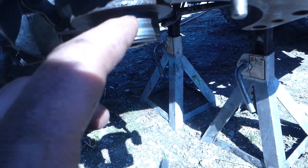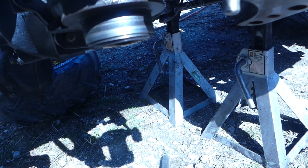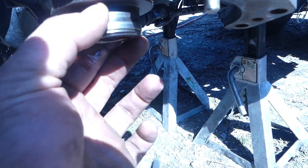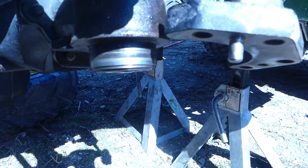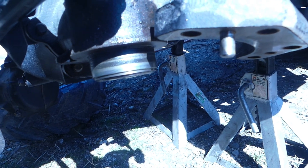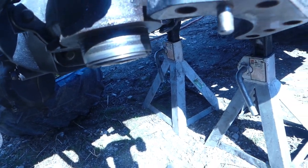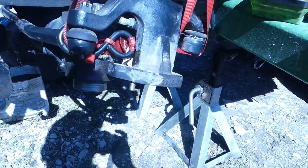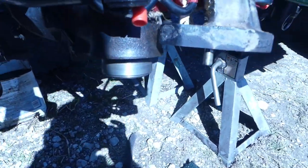And there's a couple grooves, so I might try to offset that seal just a little bit from where it was and go from there. Or, because I don't think that's a speedy sleeve by any means. No, it's just a shaft, so we'll get that cleaned up. All right, as you can see, we did the best we could with some emery cloth and our Scotch-Brite.